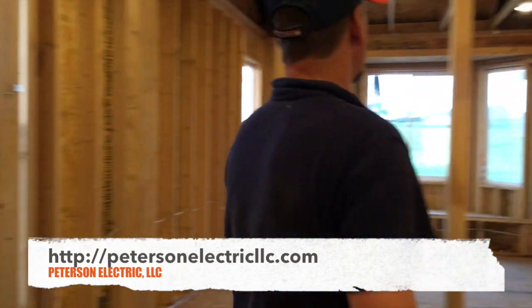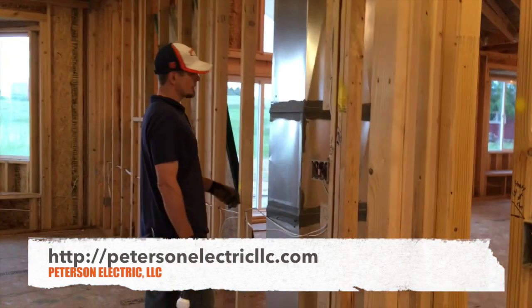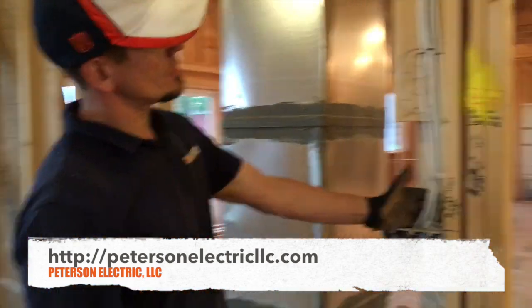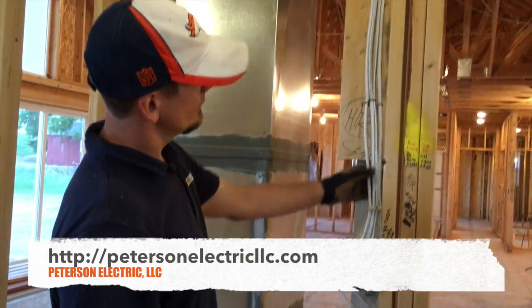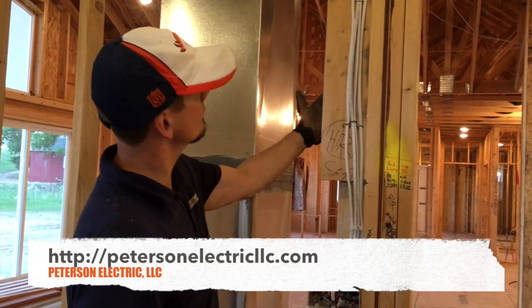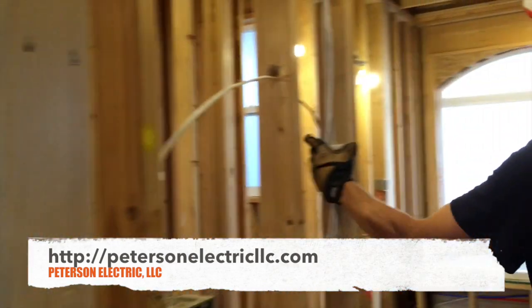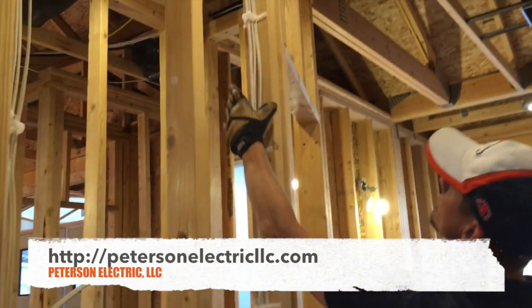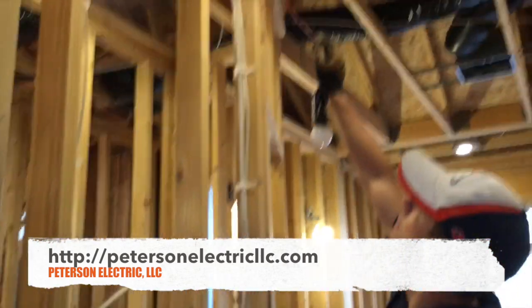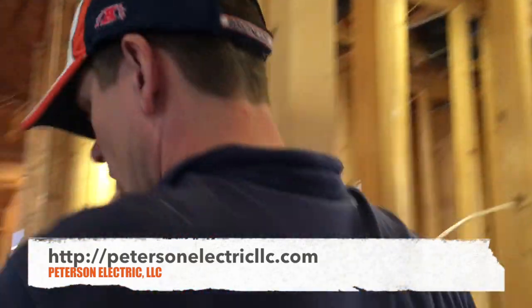I do stacks — I like to do these wire stacks like a lot of electricians are doing nowadays. These are really nice. We used to have to staple and this kind turned out fine for the back side of this, but as you come up a wall the inspectors accept these now and actually prefer them. And don't forget your fire caulk in your holes penetrating between floor and ceilings.